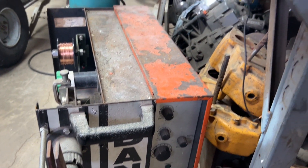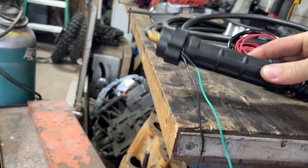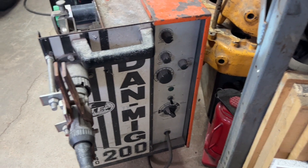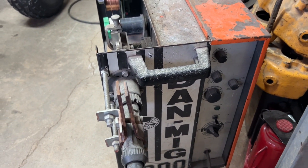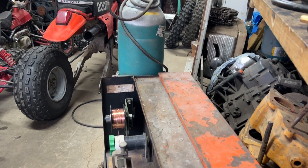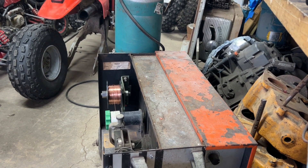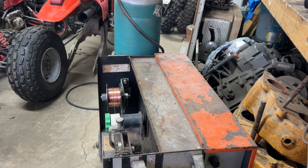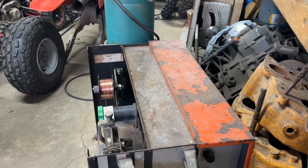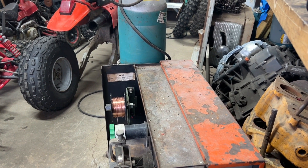In part one I made up all these wires coming out of the spool gun adapter, but I don't want to have to switch in and out the two guns all the time. I use this welder for steel. I'd like to eventually mount two tanks on the back with two regulators, but for now I'm going to see if I can just switch out the gas, leave the regulator, and switch it to the proper argon mix for aluminum MIG.